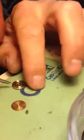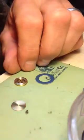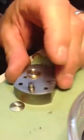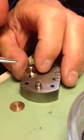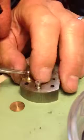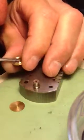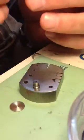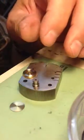The mainspring is now inside the mainspring barrel. Now I have to put the arbor in — this is tricky. You want to use a little anvil so you can push it through. The tongue has a groove with a special turn, and it looks like it goes in this way. Slide it in — that went in pretty easy. Back it up to catch the tongue in the opening on the mainspring, and that is it. Check to make sure it's caught — beautiful.